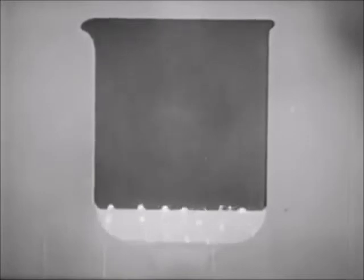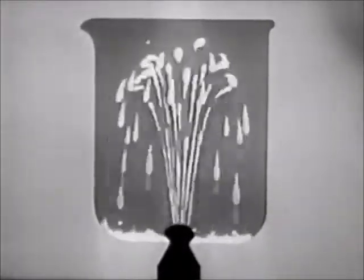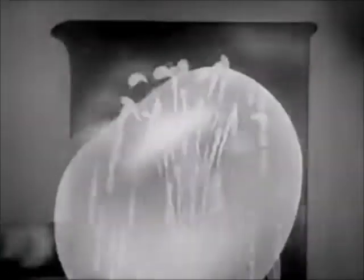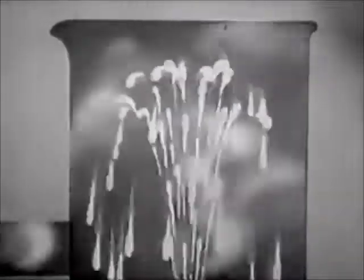But a thin layer is not practicable aboard ship because the water would swash. But we can spray the water. In the beaker, the escaping bubbles had to go all the way to the surface. In the tiny droplets, the oxygen has only a small fraction of an inch to travel. Now, we inject the steam. The tiny droplets of water surrounded by steam heat very rapidly. The steam scrubs the water and pushes out the dissolved oxygen.